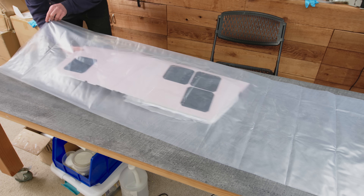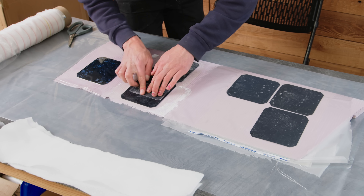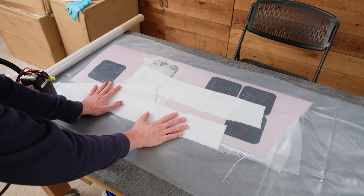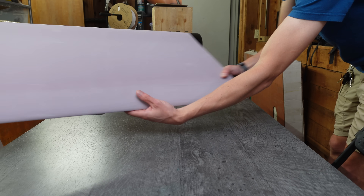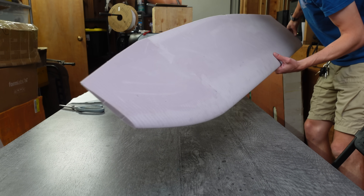I'm going to save all the details of this for my next solar plane video — but don't hold your breath because I haven't actually started on what will become the solar plane V5 yet. From these tests, I determined that I would need to vacuum bag the wing to get the composite layup to work right. And vacuum bagging such a large and delicate foam wing without having a mold to let it cure in would be pretty risky.